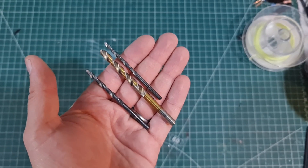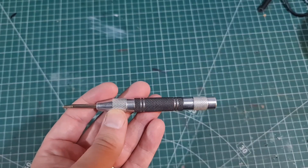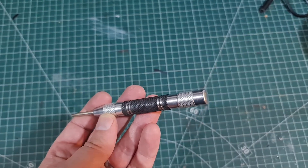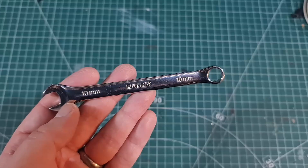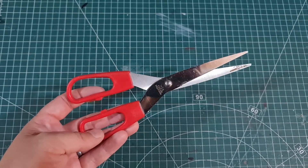For the base plate or hub: cordless drill, 6mm drill, a pilot drill, and a centre punch. The centre punch is something I wouldn't go without. We're using a paper template — you print it out, cut it out, and glue it onto the aluminium. Those spring-loaded centre punches that you just press down to indent the material are fantastic; they give you a nice accurate position on your base plate. You'll also need a 10mm spanner, 5mm allen key, a 3mm or 4mm allen key for the clamp in the middle, and a pair of scissors to cut out the drilling template.